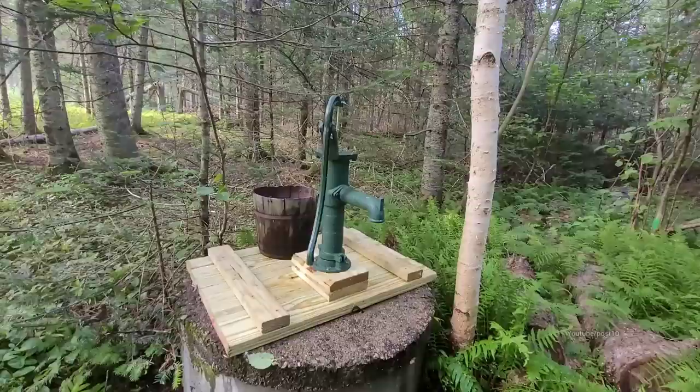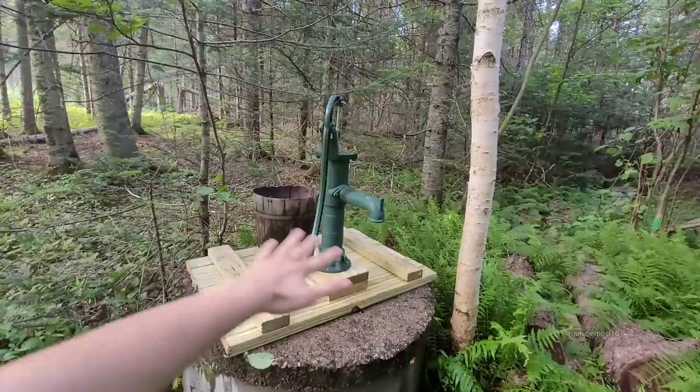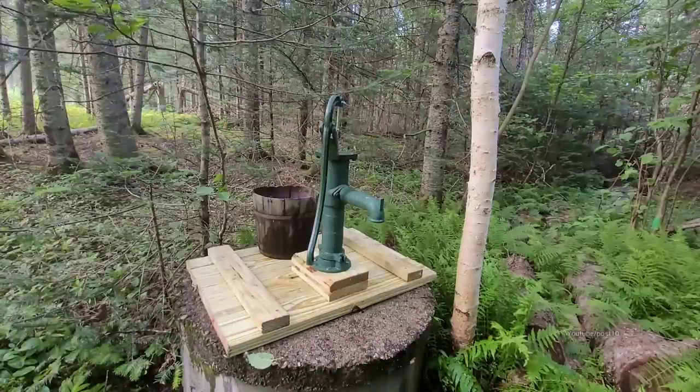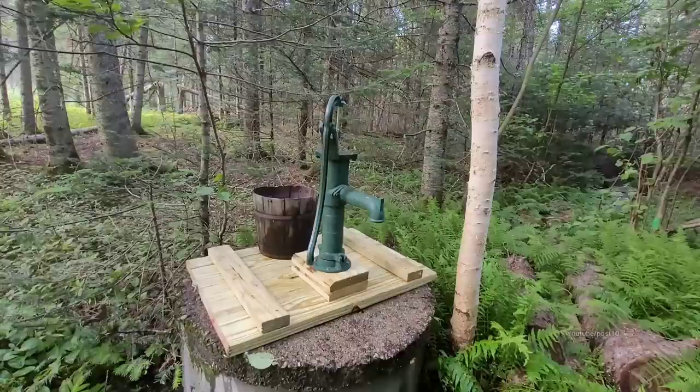That is a possibility. Now, when I was looking down inside this particular well, the one from a few weeks ago was in perfect condition. This well, the top structure here, the top piece of culvert pipe, slid like 3 inches to the side. So you have a lip on that side, and this I'm imagining is overhanging a little bit. It makes sense. This is a very swampy area along a hill. So I'm sure over the years it's slowly sliding. I'm not going to worry about it. It'll probably take decades before that ever becomes a problem. Or maybe I just accelerated the process if the ground here keeps getting wet from spillage.